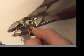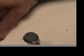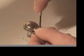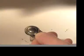There we go. It would be nice to have a jig or something to hold it. All I have to do is apply the solder. They usually ship the jack with a piece of insulating paper so that the cover doesn't accidentally touch the middle core or the tip — because again, that's not good. Here it is, and all I have to do now is add the two screws. The insulating paper keeps everything in place. There's my nifty cable.